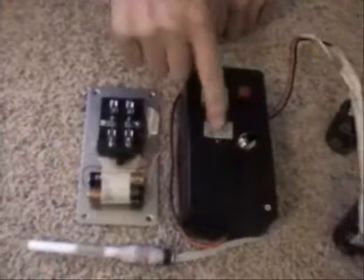First, you press the charge button to charge it, and then when the light starts blinking, you simply turn the switch and it will fire whatever magnetic material you have in there. We've been using nails as projectiles. Because it's an inductor, it actually pulls the nail with one pulse out the barrel instead of shoving it. If you listen closely, you can hear it — I don't think the camera picks up those frequencies.